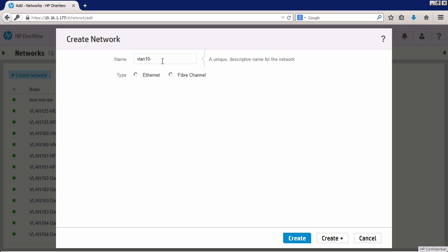usually the concept is, whenever you set up the network, there's a concept called Virtual Connect design. So with Virtual Connect, we have active-active and active-passive design. In general, I like active design better because all of my Virtual Connect uplinks will be active, able to forward the traffic. So that's what we'll use over here.